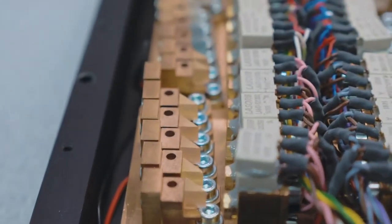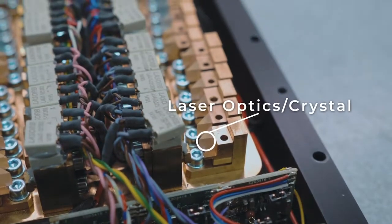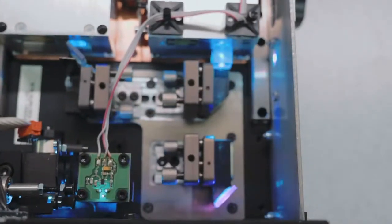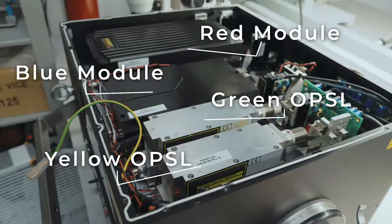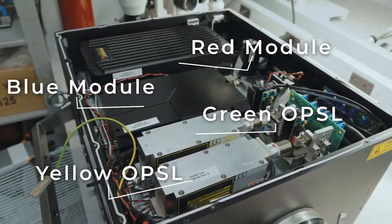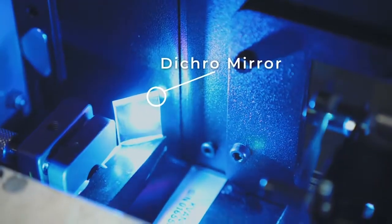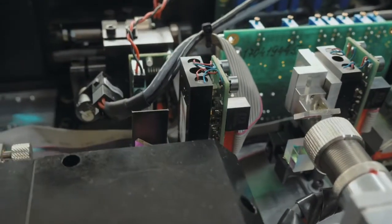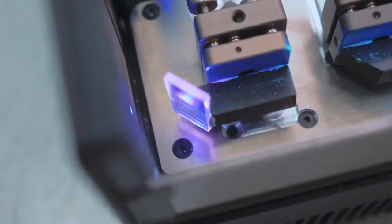The wavelength and corresponding colors can be seen on technical data sheets. The laser diodes are combined together with optics and crystals or collimation cubes to produce a white laser beam. In an RGB module like this one, you have a combination of red, green, and blue diodes which come together to produce white — all inside one module. In higher power lasers, you might see individual red, green, and blue laser modules combined together to create white. You might also notice some small optics inside — these are either optical-grade mirrors or dichroic mirrors, which allow you to combine colors. In those larger projectors with separate red, green, and blue modules, you'll often have a few dichroic mirrors which allow you to combine that beam into the scanners.